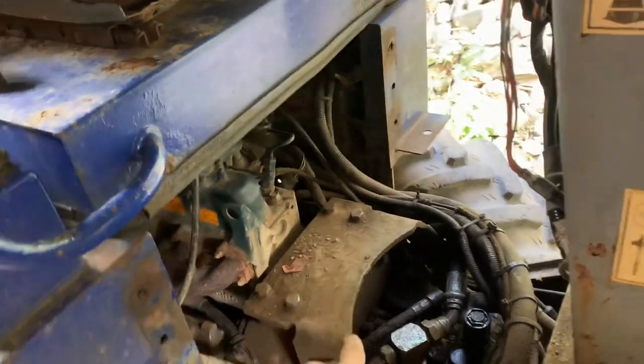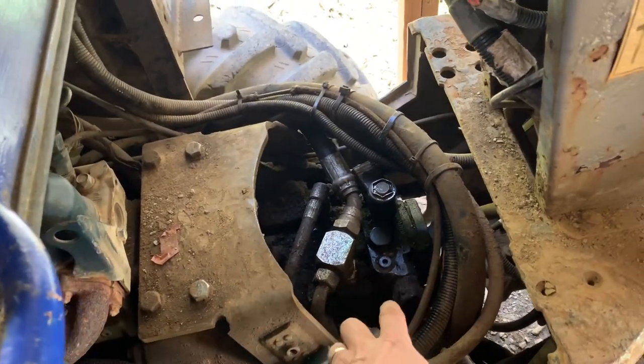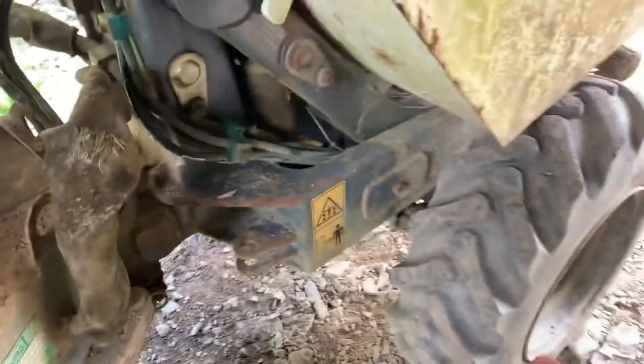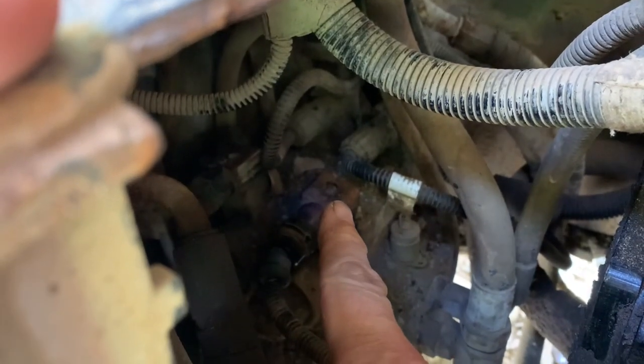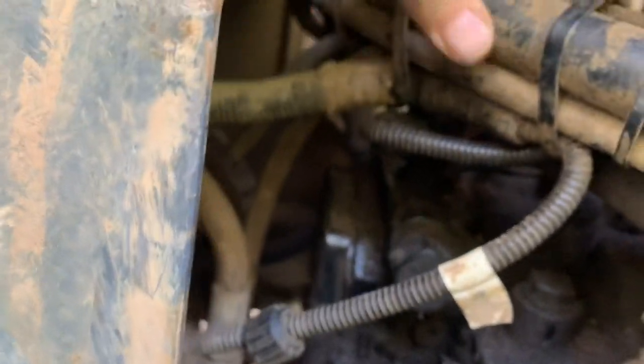There's a major pump on the front of the engine - this is the main one that drives all four wheels. It's like all-wheel drive: the pump pushes fluid down various tubes to each of the drive motors, all four wheels move at the same time. There is a solenoid on top - well, it's actually just a connector similar to what we've seen on the mechanism that controls all of this. There are four of them with these square blocks on the top, and then one here as well - I think they're some sort of cutoff valve things.